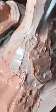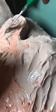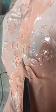But we trim some of these. I got to trim a few more. So we're doing the beauty coat just to make a smoother base, because pulling the silicone in and out of the mold later, I don't want it to catch and rip against the fiberglass. So you can do it straight on fiberglass. There's nothing that says you can't, except you're going to affect how long your mold's going to last. So doing a beauty coat on there makes your silicone mold a whole lot better, a lot fewer sharp points, a lot fewer cut points, and a whole lot easier to do in your trunk.